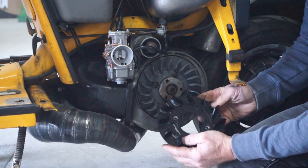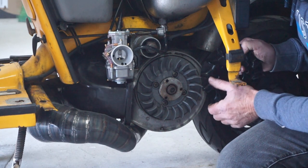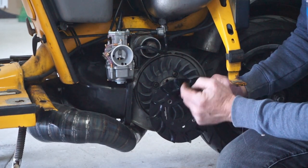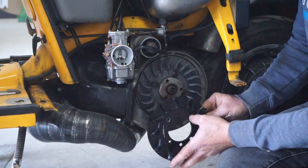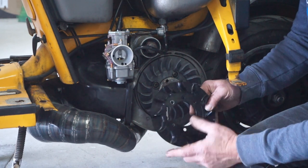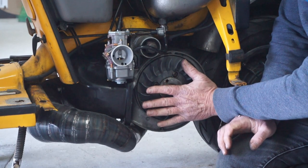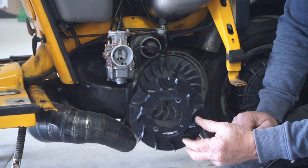The diameter is the same, but the fin area is actually less. It's got less fin area on each fin. The angle is the opposite to the original. I don't know why they've done it like that. And there's less fins in total. But it doesn't seem to be performing as well. So I think this one did 6.2 and the Casa Performance did 6. So